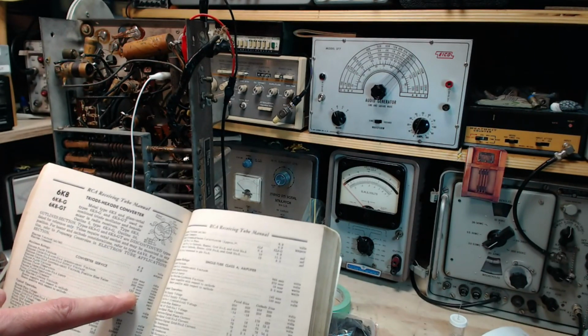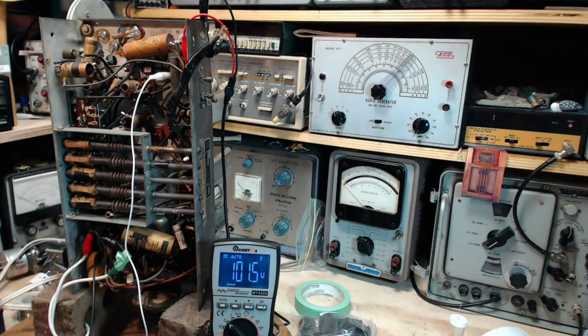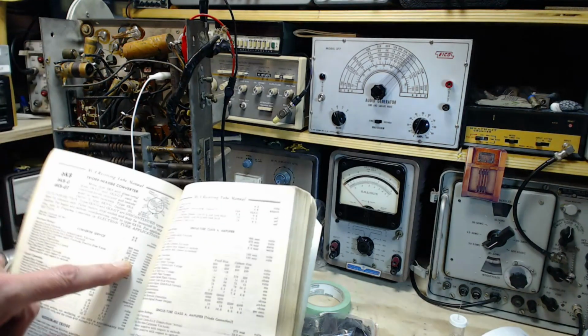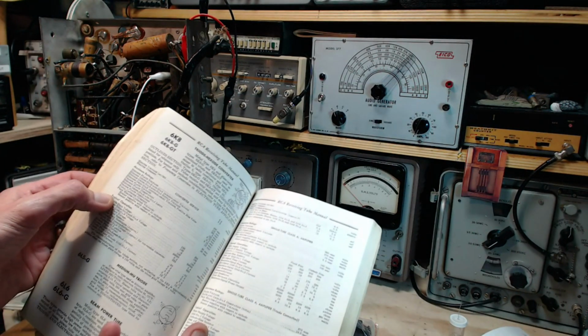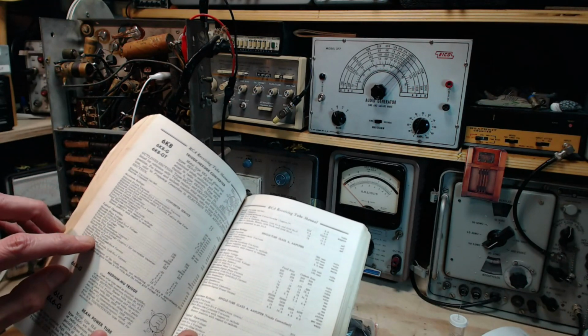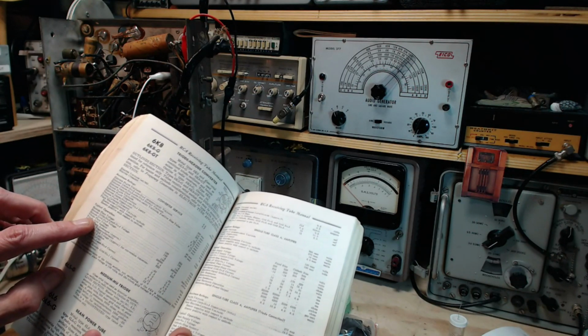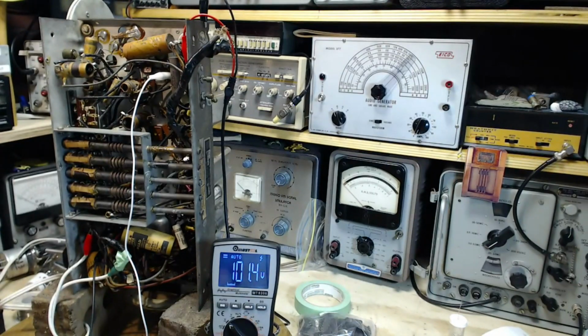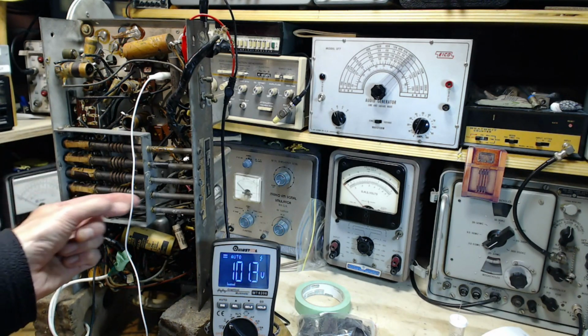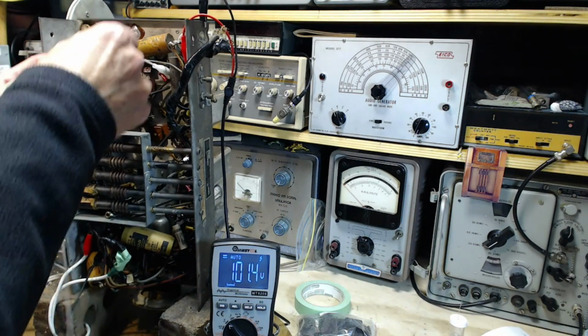Aha! Yeah, I don't like those sounds. So we're good. I think we're good. There's typical operation here. Triode plate voltage. Typical operation 100 volts. Hey! How about that? We're right on the money. So that was a good move. We'll just check a couple other voltages. They should all be okay. So I'm going to pull off this clip lead here. There we go.